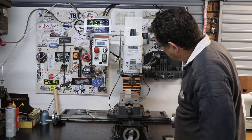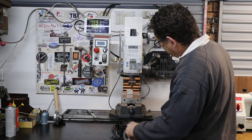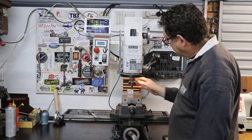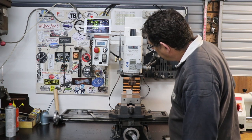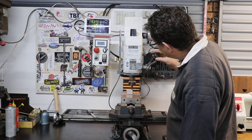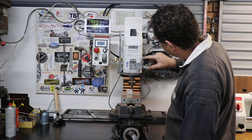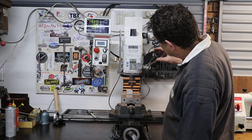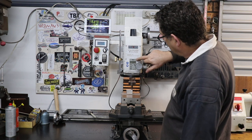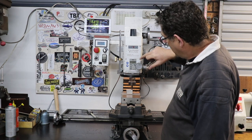Right on zero there. If I take this across the top of the work and put it in place, I can spin that and I'm pretty good there. There's virtually no play — it's going up by one, which is well within the accuracy of this quill readout. You can use your quill readout to do this as well; I often do it that way.